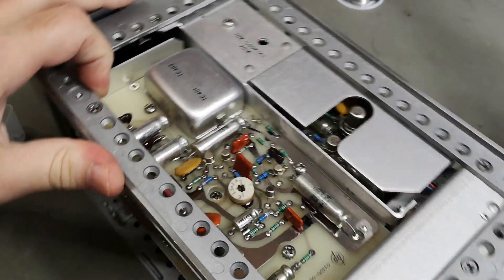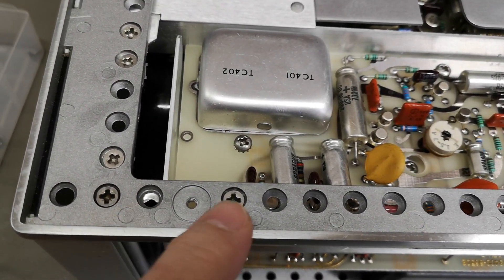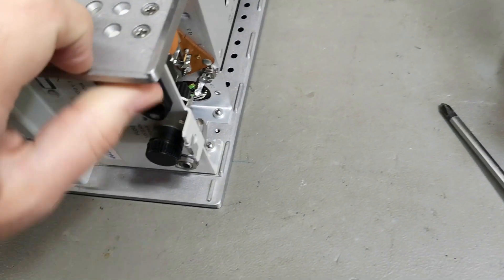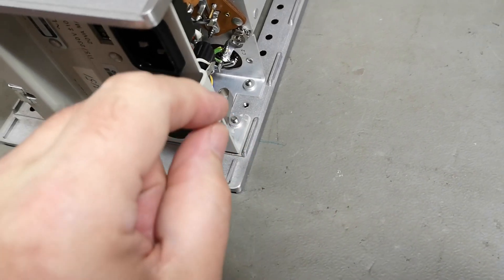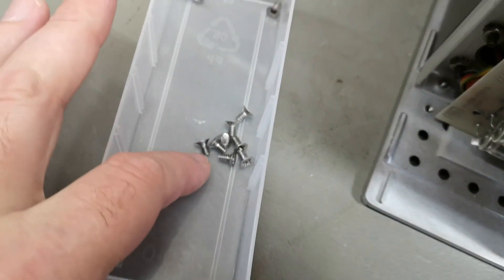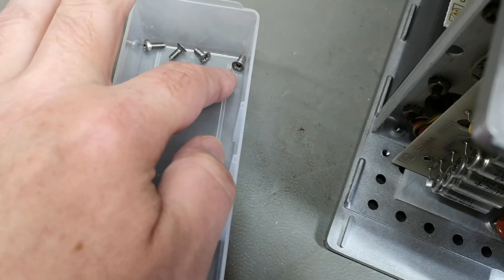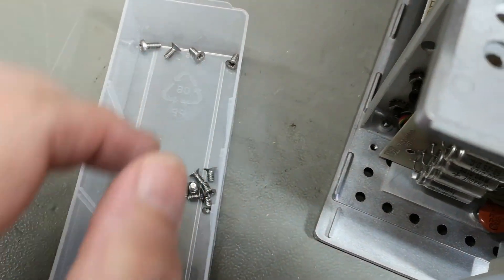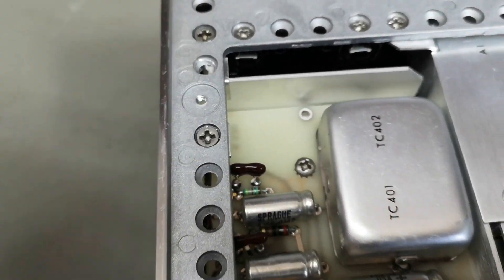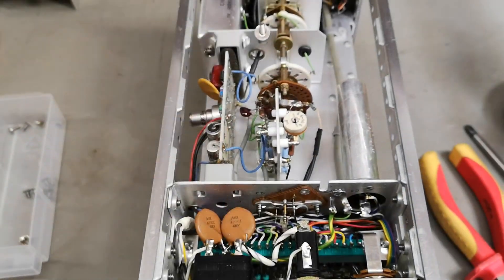While inspecting, I also find some funny things - somebody was in here before me. There's a screw missing, one of the short ones. When I took away the bottom piece, the screw just barely touched and fell out because it was assembled wrong. We have different length screws - the short ones are for the sides and the long ones are for the top and bottom, so the screws get a good grip. I'll go find a replacement since they're inch-threaded screws - we can't have loose parts.